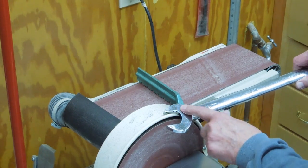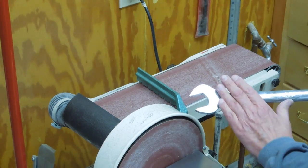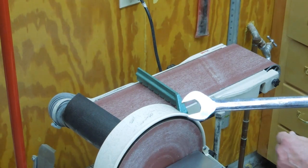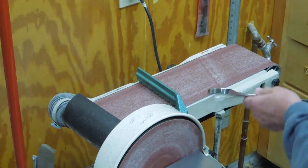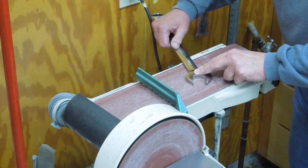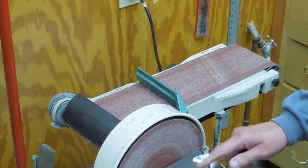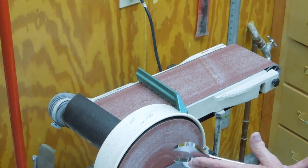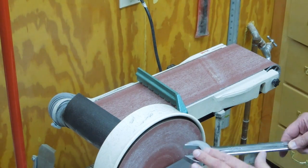I'm going to use the right angle grinder to grind away as much of this material as possible, take away the bulk of it, and periodically come in and put this on the belt sander to flatten it and to see how I'm progressing with the material removal. I do not want to take material away from these points. So after I grind on this with the right angle grinder, I'll hold it this way on the belt, then this way on the belt, and I'll get crosshatch marks. I'll see when I still have some little divots from the right angle grinder, and eventually this will become flat. I check it to see that this is parallel with the handle of the wrench, and I'll be looking to see that I'm maintaining both sides parallel with each other.